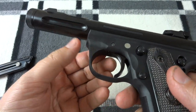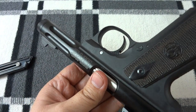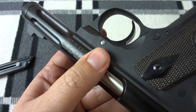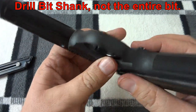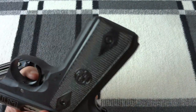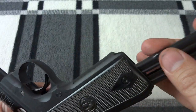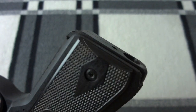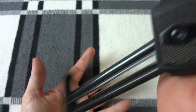It makes the disassembly a lot simpler. I also changed the trigger pin — I drilled it out with a number 19 drill bit, put a notch in the drill bit, cut it off, and I'm using the drill bit as a trigger pin, which makes for a lot tighter tolerances. I put some shims in there to keep the trigger from wiggling side to side. And finally, I removed some plastic at the bottom of the grip, which helps the magazine seat better — it sticks down a little further and makes magazine changes a lot quicker, especially with the magazine disconnect gone.